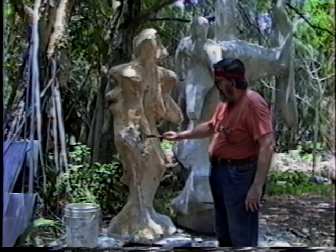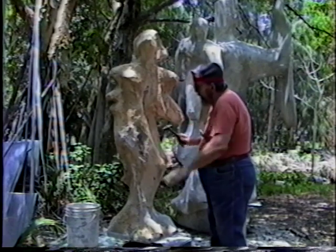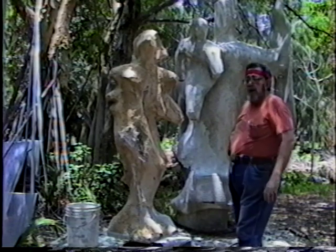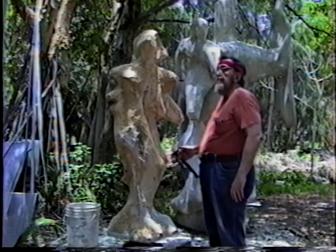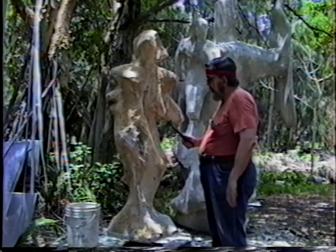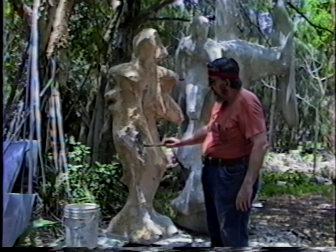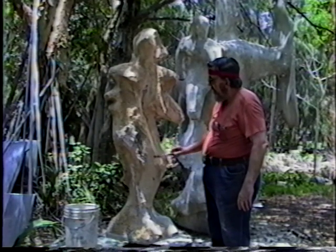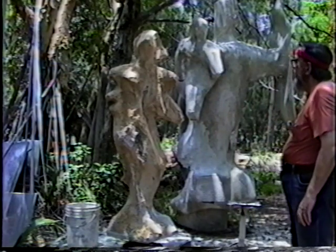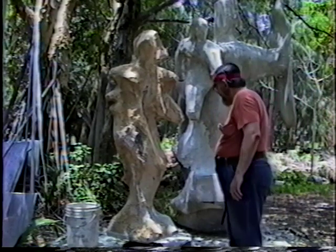Destroying all of the cement. It'll weaken some of the stuff close by. That's one of the reasons I use lath. A lot of people use, for things like this, talk about chicken wire and burlap and such, but the chicken wire and the burlap is such a big mesh that you don't have the flexibility of being able to stretch, to work on this surface like lath does. As I tell my students, lath and the world laughs with you.